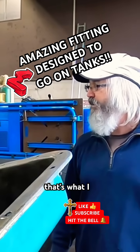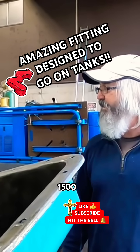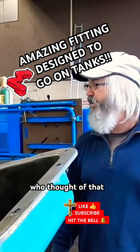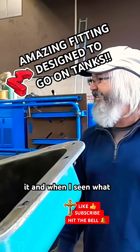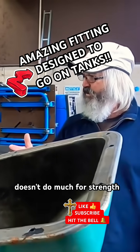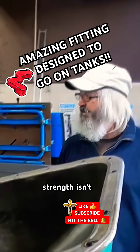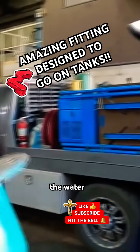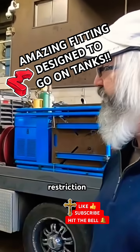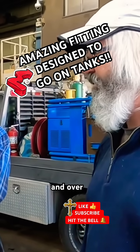That's cool. The guy driving it — the operators tell me they don't even feel the water move at all. That's what I was telling Steve. I didn't know if it was for strength. That weight of water — 1,500 gallons — if it starts sloshing it could actually topple things, and that stops it. Who thought of that? Well, they wanted me to baffle it and when I saw what they were putting it on, I baffled it like crazy. The baffles help the sidewalls a little bit, but the strength is all in the quarter-inch plate — baffles are strictly to contain the water movement. Free-flowing water with no restriction on pumping it out, but no movement inside when they're going across and over logs.